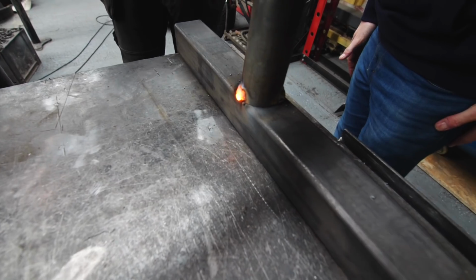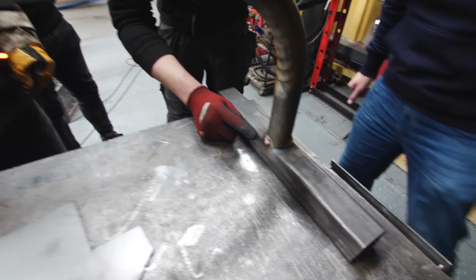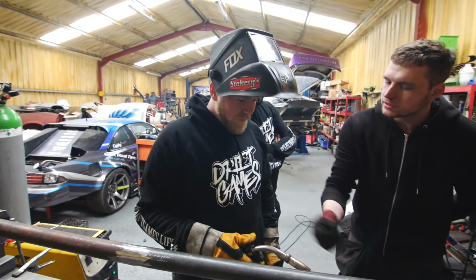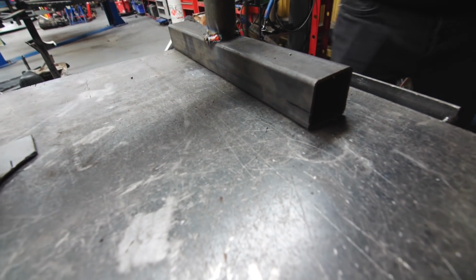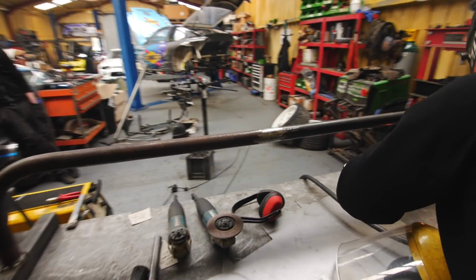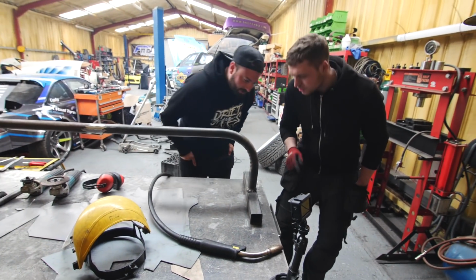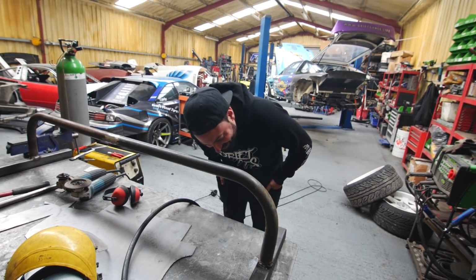Wow! So see the way that bubbled out? Yeah. Actually, the start was pretty good. I gotta grab it away. When it bubbles out, when you pull away, it's not getting gas coverage, and that's what happens. The sparks going everywhere. Made me look crap. Bridge it across, alright, Joe? I don't even think mine's connected to the bit below. That might have been by design.